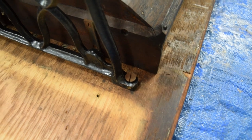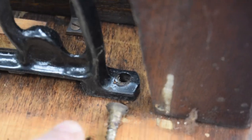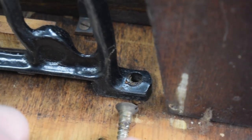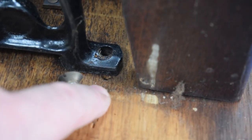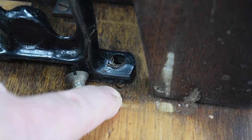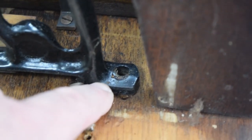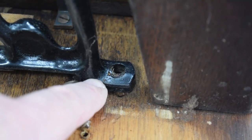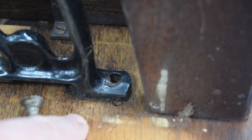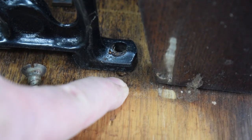It's only held on with four screws, two on each side. And interestingly, on this side, I've pulled this screw out. Perhaps you can see the original screw hole is here. This had been mounted in about a quarter of an inch closer to the cradle assembly. Apparently this was removed at one time. Perhaps this original screw hole is stripped.